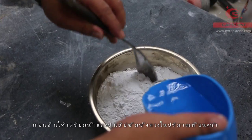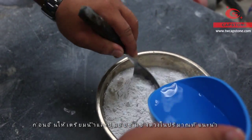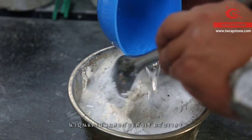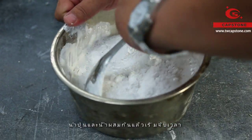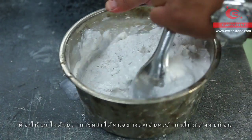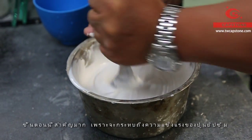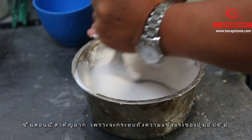In the beginning, weigh the gypsum and water individually according to the recommended ratio. Mix the gypsum with water and start the timer, then stir violently to ensure no gypsum aggregation is in it. This step is very important because it will affect the gypsum strength.